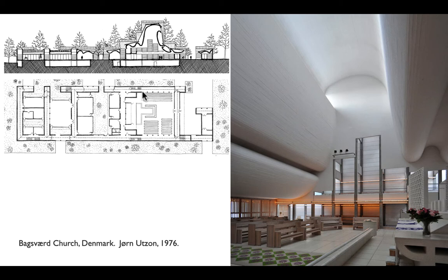As long as its behavior is that of a beam or a folded plate, it doesn't really matter what its cross-sectional shape is. All that matters is that it has some area at the bottom, some area at the top, and a connecting or stiffening piece between — working the same as an I-beam.